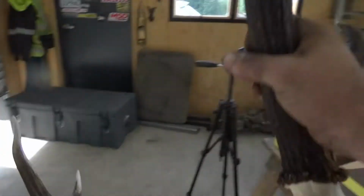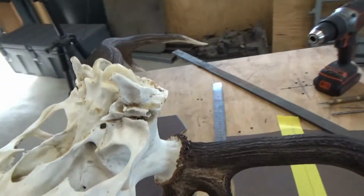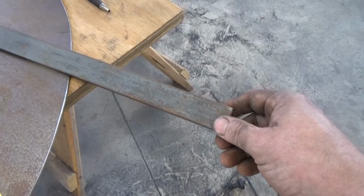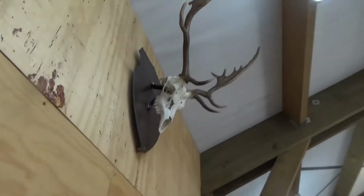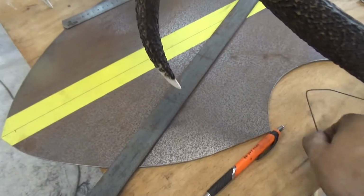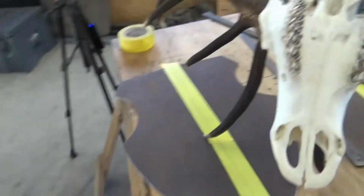So we'll start with this big fella, get him up on here. So the bracket that I do is just out a 30mm flat. So you just pick this up from local engineering shop, they'll have plenty of it there, it's quite a common size. So we want to bend up a bracket that sort of looks like that. So I've got a little mock-up bit of just wire, so you can sort of just use this as a template.